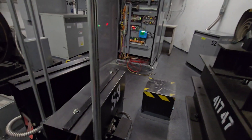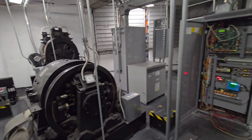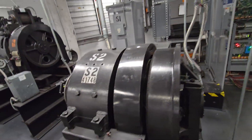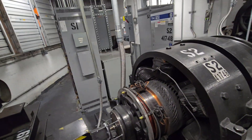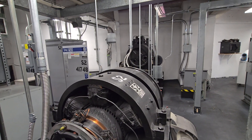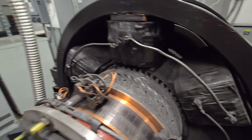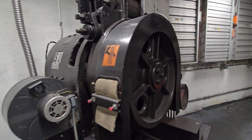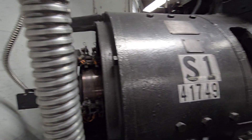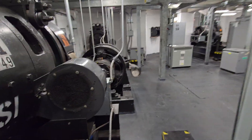And these are the safety governors. When the elevator goes too fast, these will trip the safeties. I believe if it goes 125%, it'll cut off the motor and engage the brakes. And if it goes 150%, it'll activate the guide wheel grippers — the main safety ones that everyone knows about. Let's take a look at the motor for this one.